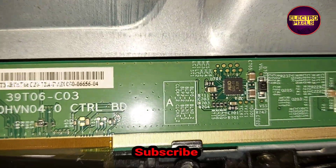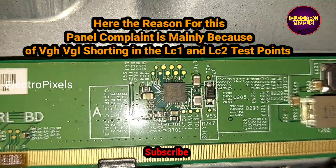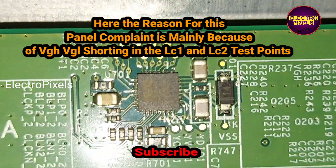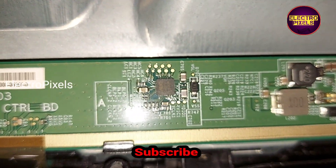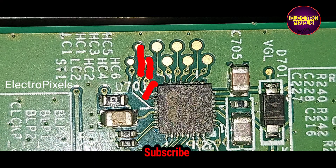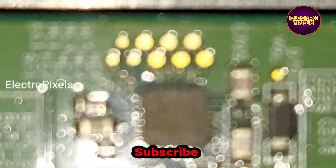The reason for this panel complaint is mainly because of VJ odd/even shorting at the LC1 and LC2 test points. In the picture here, you can see the marker lines indicating where to cut the LC1 and LC2 tracks from the level shifter IC to prevent voltages from entering the panel.